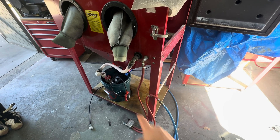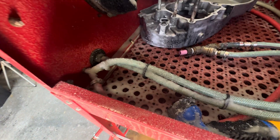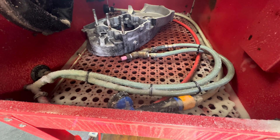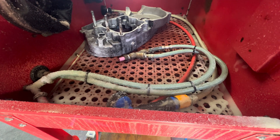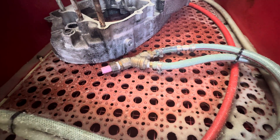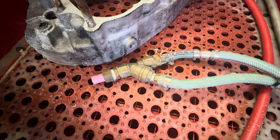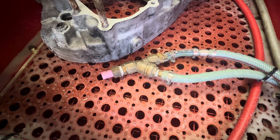So at the business end, we've got the slurry line coming in and the air line in here. Inside the cabinet, I'm pretty sure it was 5/8 or 16mm for the slurry and half inch for the air. There's plenty of debate about the right sizes for the lines, but if you want to copy this one, this works okay with the setup I've got - don't overthink it, just build it. That feeds the mixing gun. This is the Armoury Enterprises design made out of plumbing fittings. I made the air needle myself on a lathe - there's a booklet for about 12 bucks to explain how to build it. If you don't have a lathe, just buy one - there are different designs available on eBay.